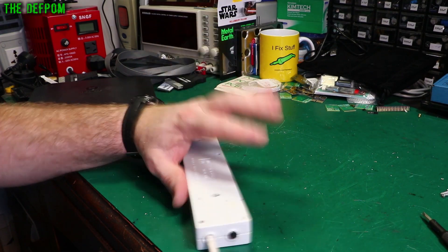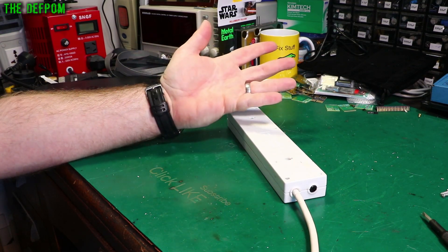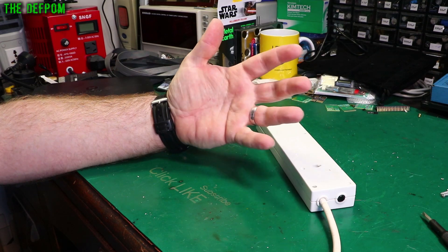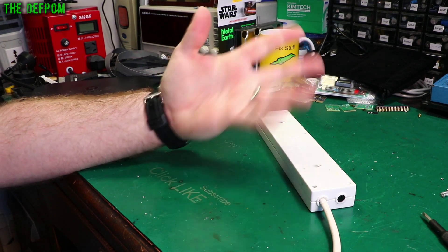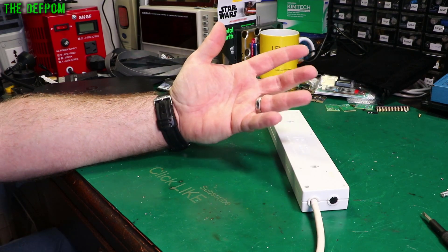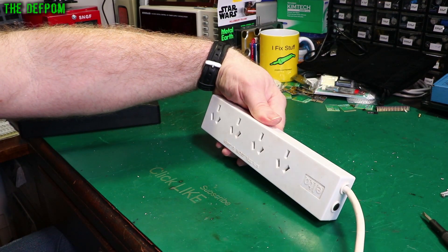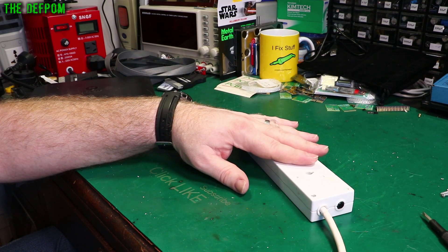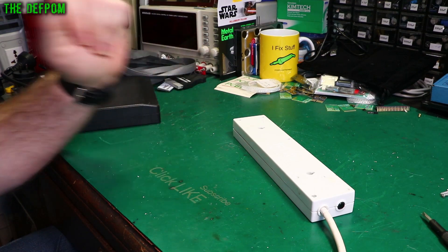My recommendation when it comes to buying power boards: do not scrimp. Do not buy the cheapest boards. I didn't buy this — I think it was some junk being thrown out by someone, and I had a whole bunch of boards in it, some good, some bad — this one being bad. Do not scrimp. Buy the better ones, because it's not worth having a house fire for the sake of trying to save $20. Not worth it. Buy a good one. Get one with surge protection built into it as well — get one of the slightly better ones that also protects your gear. This has only got an overload, and to be honest I don't think it's going to take 10 amps — I think it'll probably melt before then. Don't buy cheap. Cheap has its place, but not when it comes to mains electricity. This is your public service announcement. Don't forget to click like and subscribe — catch you next time.